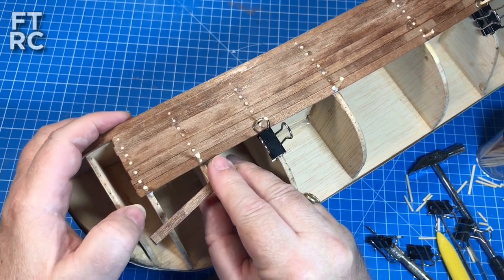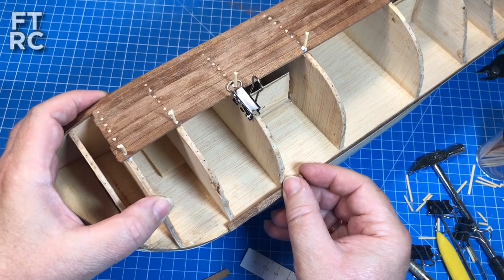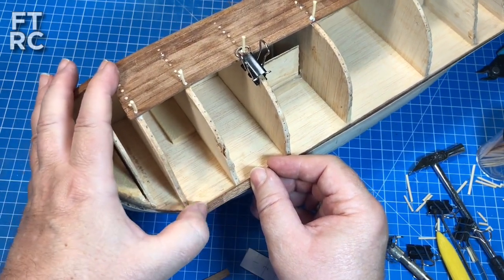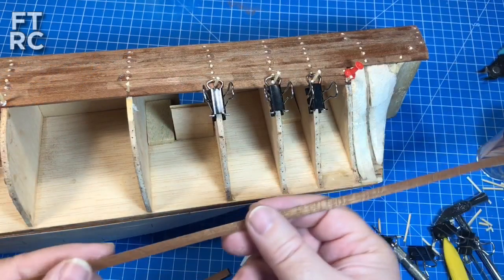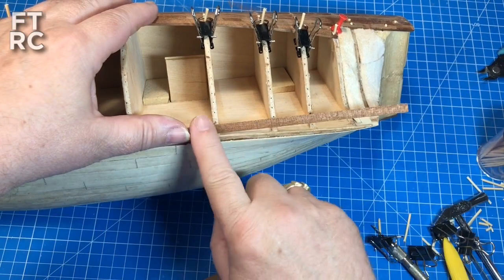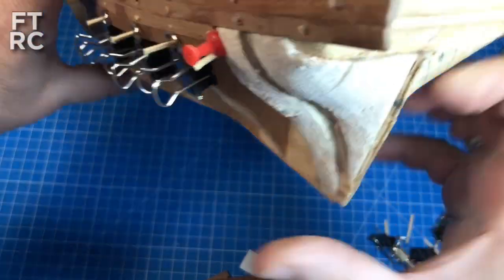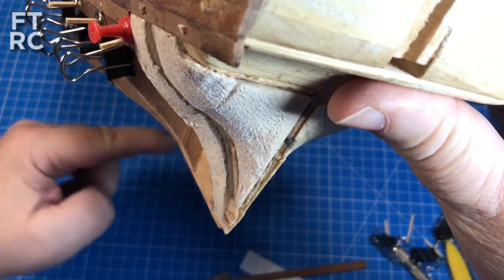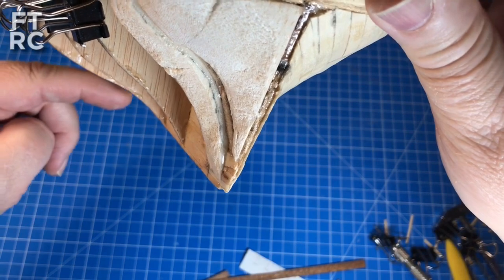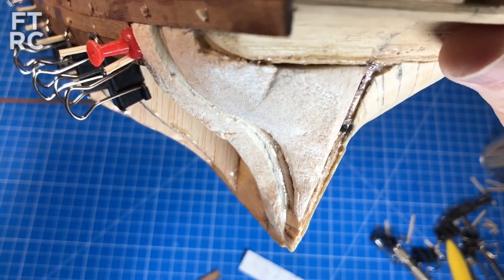So what you do is you don't chop it off the bottom of that one. No. You always taper off the top, except your garboard plank, which is a bit different because that basically doesn't get tapered. It goes on 100% the size. And then as it runs through at the bottom here, we just cut it to the profile of the curve. So the garboard plank does an unusual curve here, where it's not actually curving up or needing tapering, but it starts level, starts flat, and then turns 90 degrees. It's probably easy to see side on. So if you're looking side on, you'll see here the planks lay that way. Not like the Haridini is. So here the planks are basically laying that way. Okay, so that plank is lying nice and flat.